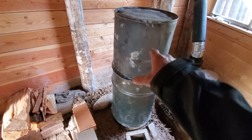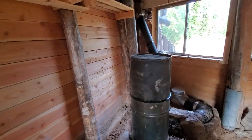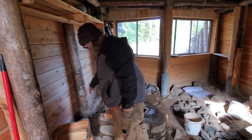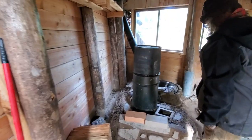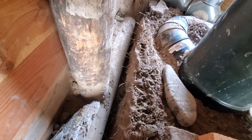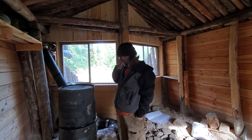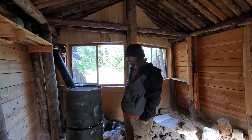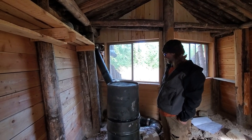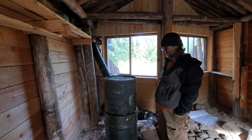Having a relatively large radiant barrel makes a big difference for quick heat. I really like how this is set away from the wood over here, because if you're sitting here in the middle of winter burning your rocket heater twelve hours a day, you can get a cob mass up to the point where it's dangerous to have it near wood. So having an air gap there — if it does nothing other than give peace of mind — it was worth all the extra trouble. I think it actually does make a difference to have air gaps and to not try to push your system too close.